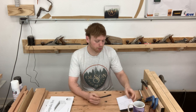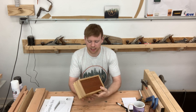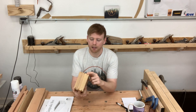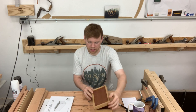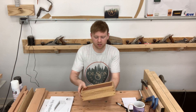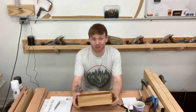I worked on a keepsake box and uploaded a video to YouTube earlier this week. It's made from quarter-sawn sycamore for the exterior, with a veneered leopardwood panel and a veneered Sapele bottom panel. I branded my logo on the bottom. It has mahogany miter keys and Brusso 103 stop hinges that keep the lid open — they don't let it fall all the way back. It has a nice little finger-pull recess and closes real nice.